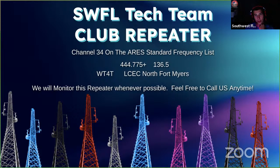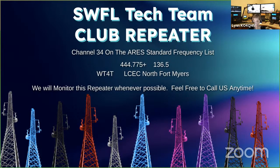We've got the Southwest Florida TechNet club repeater. Y'all gotta get on there. When Ian's out of town, no one's on the repeater. It's dead silent and goes back to being unused. It's 444.775, tone of 136.5. We monitor this repeater. I was monitoring it all day today. Every time I'm mobile, I call out that I'm mobile and monitoring. It's got a really good footprint. It's over on the Lee County Electric Co-op, and you'd be surprised at how well it gets out, considering the antenna itself is only about 30 or 40 feet off the ground. We'll have to try that then. Yeah, definitely give it a try.